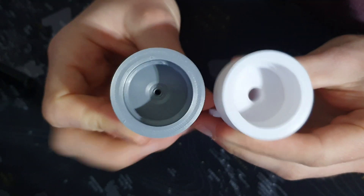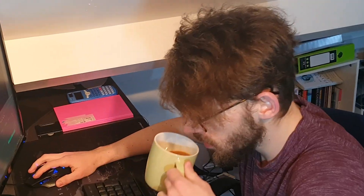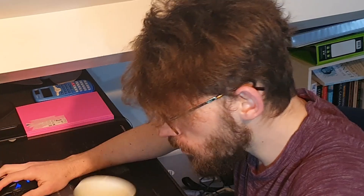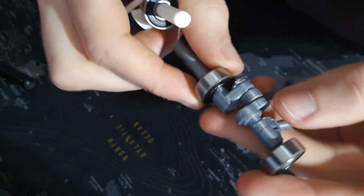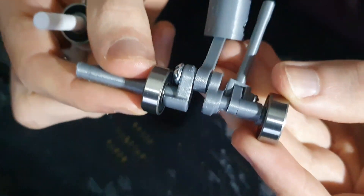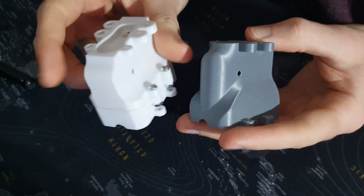The second major change is the diameter of the air inlet. I've decreased this to try and improve the run time. This was an awful idea because I'm a complete idiot. There were also a few minor changes to the crankshaft and the piston cylinder, but these were mainly to try and reduce the weight of the engine. The engine is of course powered by compressed air, so ideally I would use an air compressor.